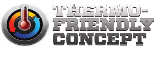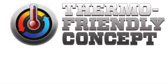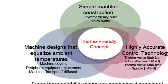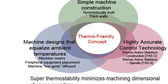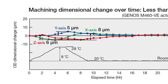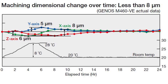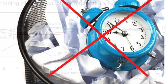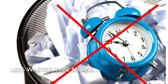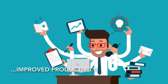The M460 is also designed through construction and intelligent technologies to effectively manage the heat that is produced, delivering a more accurate and reliable product. They use temperature sensors in the spindle and casting that actively read the temperature in the machining environment and automatically compensate behind the scenes in the control, so that your operators can spend less time chasing the machine around and adjusting offsets throughout the day and more time performing work that is valuable to you and your business.